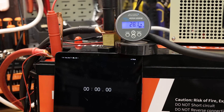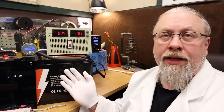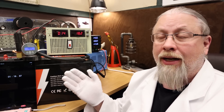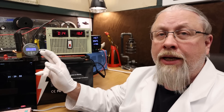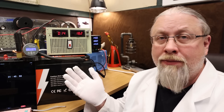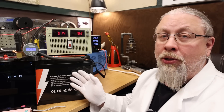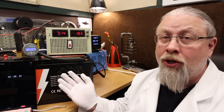We're starting off at 28 amps from the two smaller chargers. Kicking the big one in — and there we have it, 147 amps. While this test is running, you might think why bother testing at 150 amps? Well, the reality is you're pretty much not going to find any chargers on the market that run 12 volts at 150 or more amps. Right now we're pushing 2,000 watts into this battery, which is quite a bit, and that's a lot of amps to run through cables. Very few of you buying this battery will ever charge it at 150 amps or higher — most of you will buy multiples and put them in parallel where they'll split the charging load anyway.